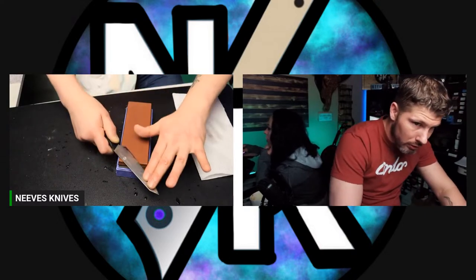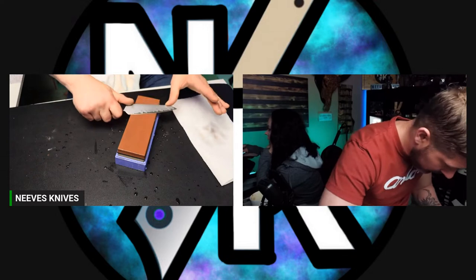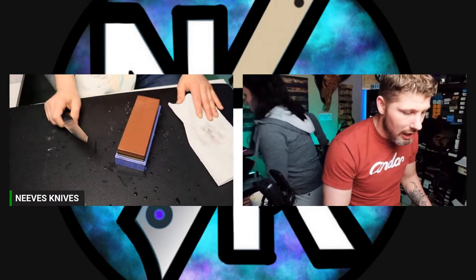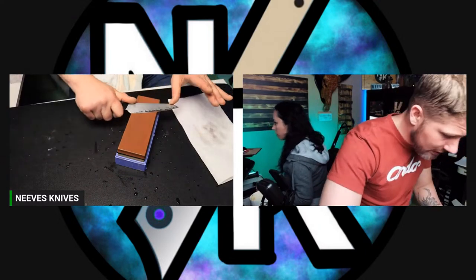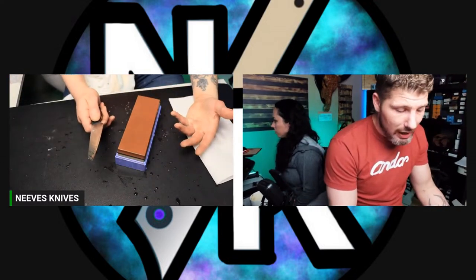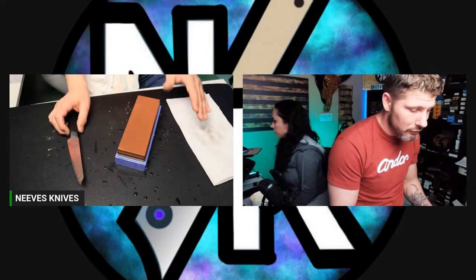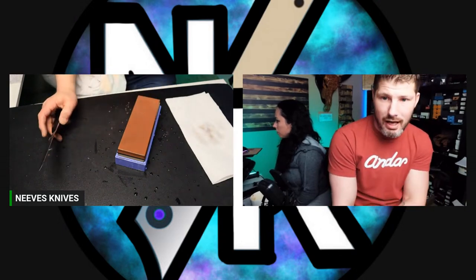When am I supposed to knock the burr off when using the Neeves stone set? Is it when I get past the low grit stones? I never know when to do that. You don't have to worry about knocking it off until your last stone, but every time you switch sides, say right now, when I'm on this side, I'm going to sharpen until I create the burr. Once I get the burr, since I've already done this side, I can go to my next stone. Now, when I go to my next stone, I can knock the burr off and then continue sharpening, but I don't have to. The point is that if you've created a burr on both sides multiple times, your last burr is the burr you want to knock off.